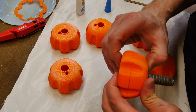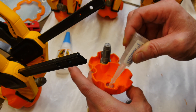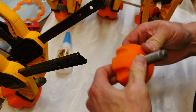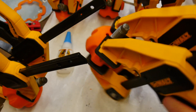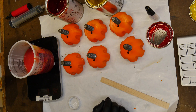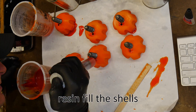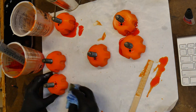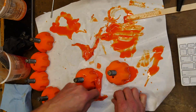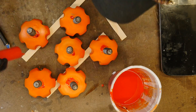They need to be clamped together while the super glue sets up. There's a little bit of distortion caused by the wing nuts onto the knobs, so I anticipate they're going to leak a little bit — thus I have parchment paper underneath. Resin doesn't stick to it; it's wax coated. And of course they do leak a little bit. We'll let them cure, and before the resin cures all the way I can peel it easily off the knobs, then come back with a second round to top them off and fill them solid. That's why I use the orange resin.